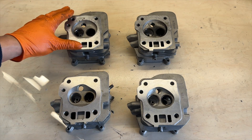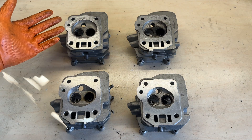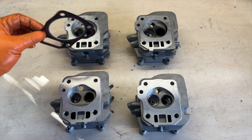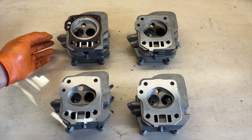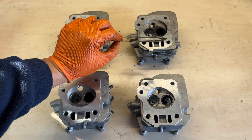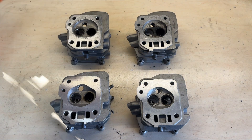For the 24.5mm intake head, I use it on the ZR12 which is about 12 to 14 horsepower — really around 14. I paired it up with the stock gasket, which is a fairly thick gasket, and even with the thick gasket and lower compression ratio it's able to push about 14 horsepower. With a much thinner gasket this allows it to do 17 and above.